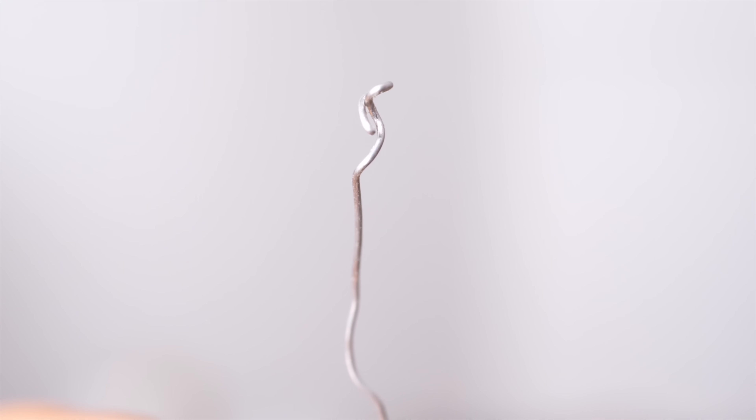I say all you have to do is make one end hot and one end cold. Actually, there's something a little unusual about the wires. They're not made of copper like wires normally are. Instead, they're made of two different alloys. One is called chromel, the other is called alumel. There's nothing particularly special about alloys in general — an alloy is just a mix of different metals. In this case, mostly nickel, but with a few different ingredients to differentiate the two.